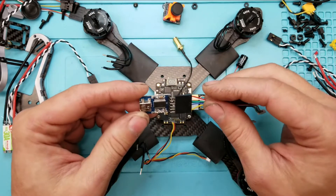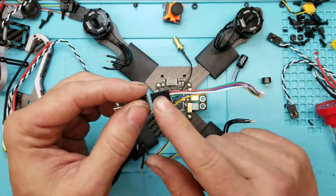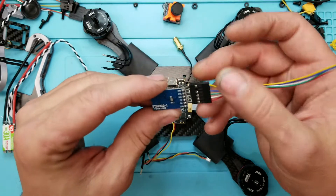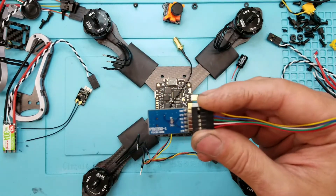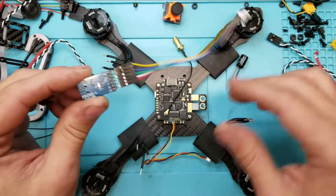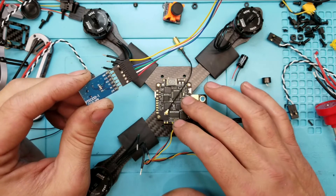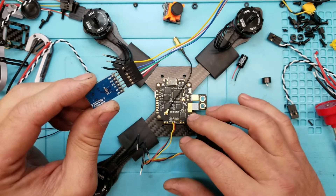I just like getting everything done beforehand while I can have the board in hand. What you want to do is get an FTDI — this harness here already comes with this all-in-one flight controller, so you just plug it into your FTDI. It's already laid out for you; it's really simple. I'll put the link down below in the description for you to download. Once it's hooked up, make sure on your OSD that you select the right battery pack — 4S, 3S, whatever you plan on running. The camera setting is also really important, so whether you're going with PAL or the American standard, make sure that's properly selected.